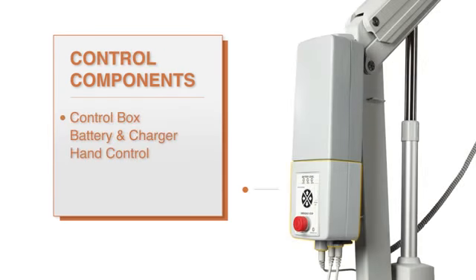A fully charged battery pack will illuminate green and above 50% on the LED. If the battery is showing less than 25% and the red LED is lit, do not use the lift as the battery may not have enough power for a full operation. Remove the lift from service until the battery is fully charged or replaced with a fully charged unit. It is important to charge the battery when the lift is not in service, as fully discharging the battery can affect battery life and performance.